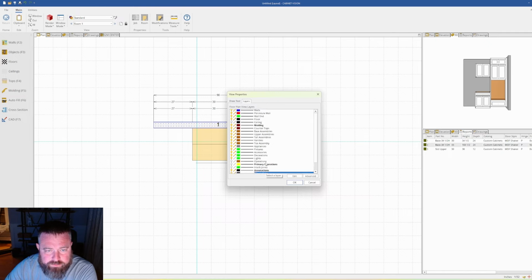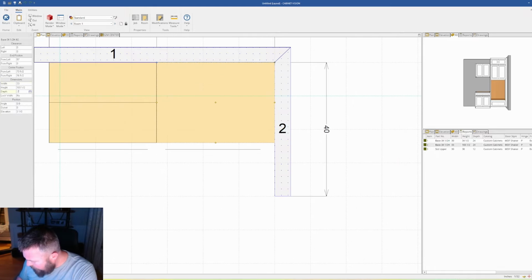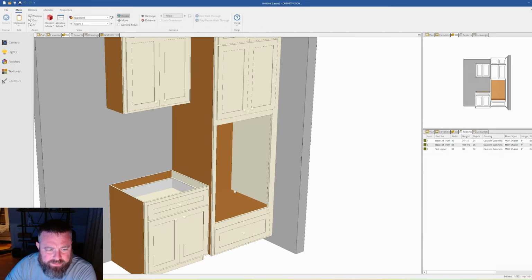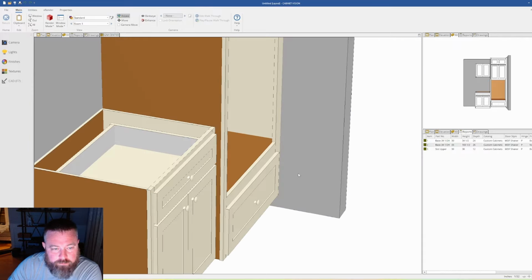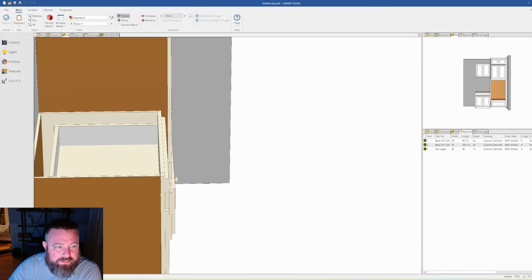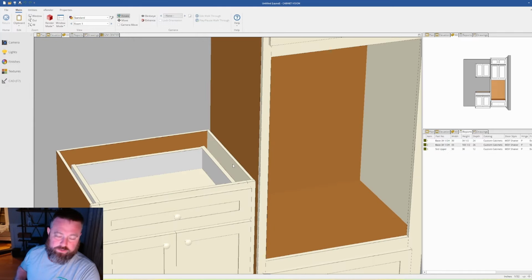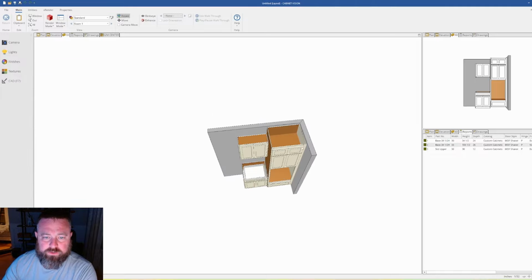Primary operations, whatever. Okay, these cabinets, I tried to make them around 26 inches deep. The reason is, for one, it gives you that extra depth for any electric on those oven units. And 2, it gives a nice little lip here. When the granite guy butts his granite up, nothing sticks out. It butts nice and flat against the side of that cabinet, and it gives a really clean place for the granite end to die into. So 26 inches deep, and then however tall you need.